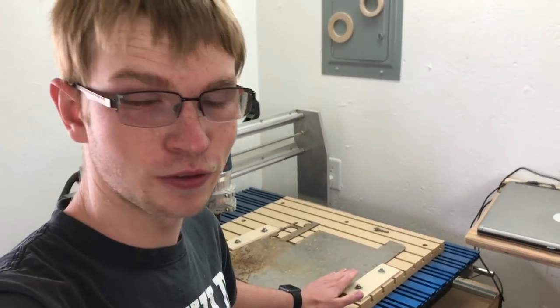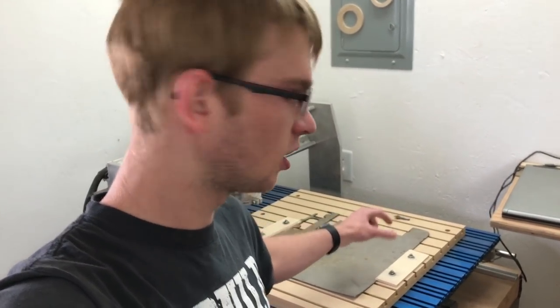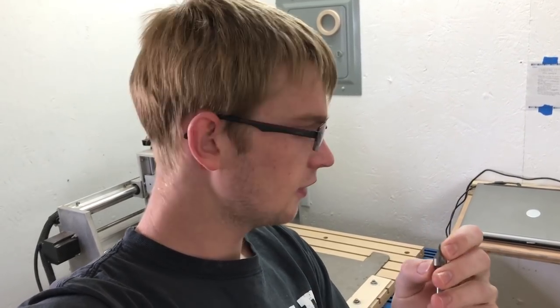I've never used my CNC for metalworking before, but I'm going to try to engrave the US flag and 'Made in USA' on a little square piece of stainless steel. I want to get pretty intricate with this because the badge has to be pretty small to fit on the machine, and I want to make the US flag with all the stars. So I'm going to use this v-bit. Hopefully this point will be able to engrave — it's probably 30 thousandths wide at the point. I've actually upgraded v-bits since this one because for woodworking that 30 thousandths is a bit of a problem, but I think it'll be about right for this. It should act about like a 30-thousandths end mill, and yet the structure of this v-bit will give it a little more strength than just an end mill would have.